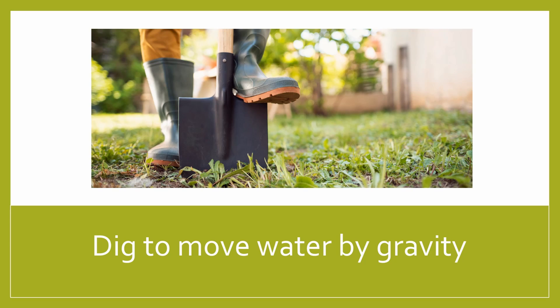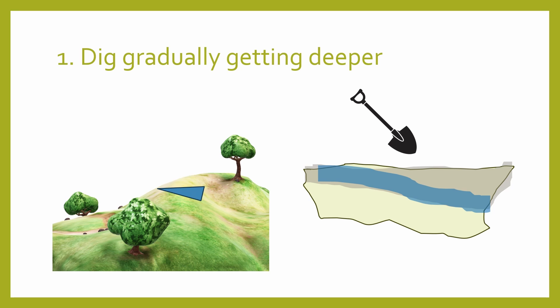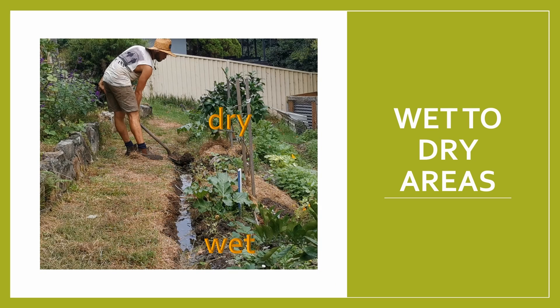There are two ways to use gravity to move water across the landscape. The easiest way is to dig through every mound that is in the way. But the long-term problem is that as you dig deeper and deeper, it will eventually block up because when the water is still, it will drop silt. Sometimes you just have to dig deeper until the water gets to where you need it. You can see Grant re-digging the swales at Gillies Kitchen Garden in Otford — we found an area that was always dry, and discovered the wet area was leaking water into the gardens below, so we had to re-dig the swale to make it level.